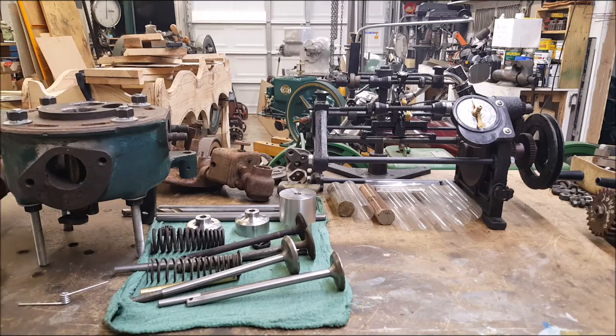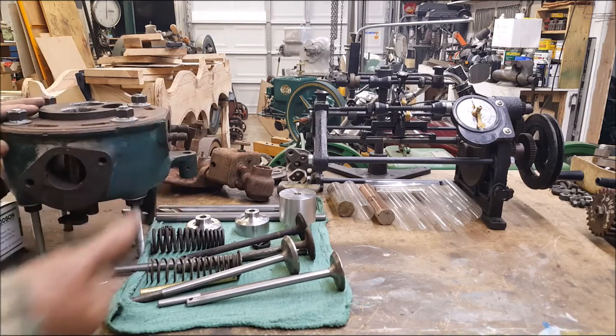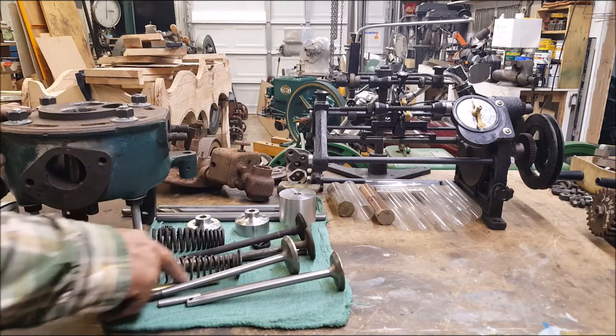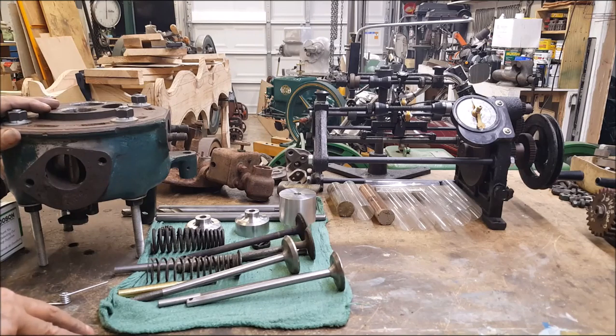You know, I have this, which is about as good as you can get. So you might as well have a pilot that maybe they're within 0.0005 or something down there, like way down there. So if this is a thousandths, then that means that seat, if it telescopes that over there, you know, it'll be 2-3 thousandths. So you try to eliminate all possible, do the best job you can. So I'm gonna wait on that pilot. Now we'll go ahead and work on them valves.